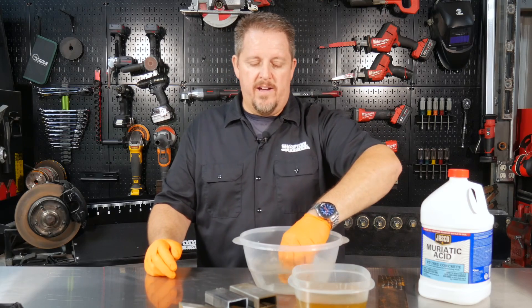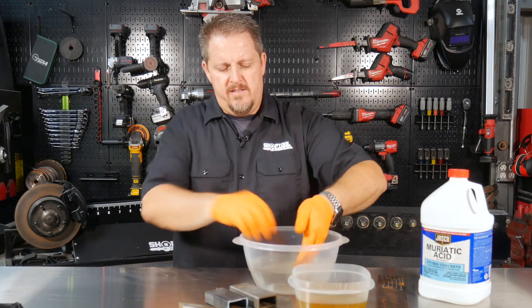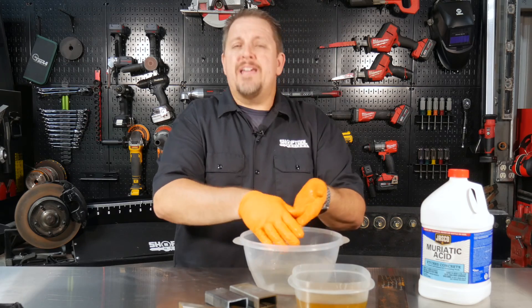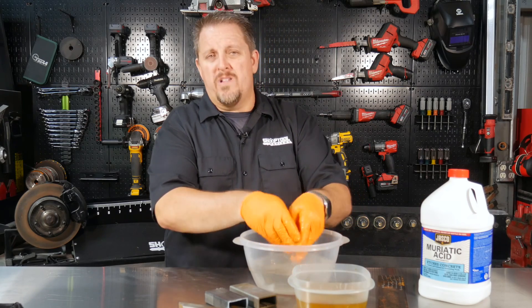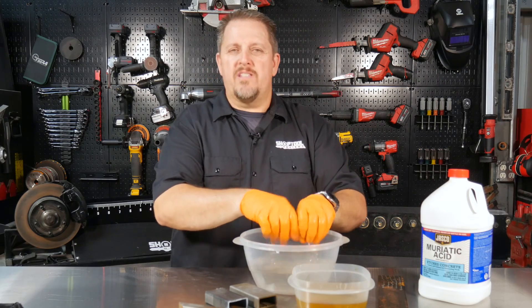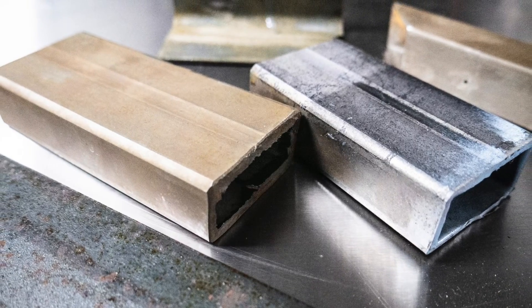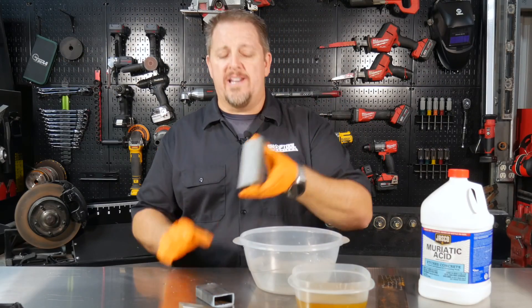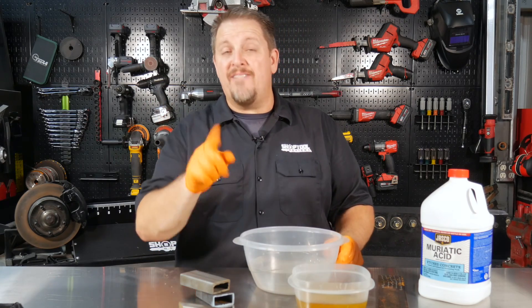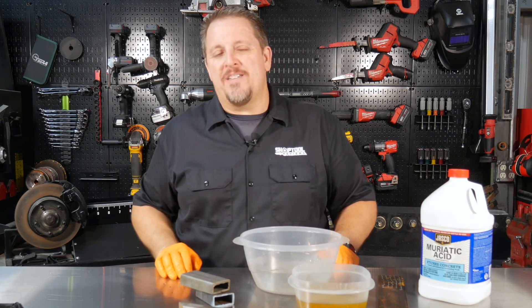As I mentioned, be very careful with this. This is just water here to neutralize the acid — baking soda will work well as a neutralizer as well, but water will work too. So just make sure you rinse really well. When you get it on your skin, it'll feel really slick, so you'll know when it's on there. So that's the easy way to get good clean steel so that you can weld with it, so that you can paint it, whatever you need to do. Keep track of us on Instagram, Facebook, and Twitter — hit that like and subscribe button, and even that bell notification, because then we're going to notify you of future videos. Have a great day and go out and do something nice for someone.